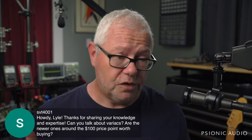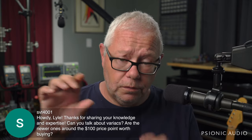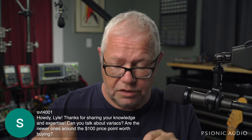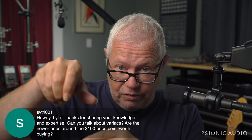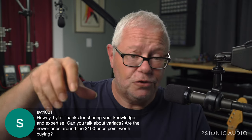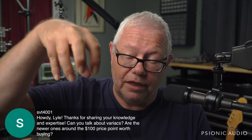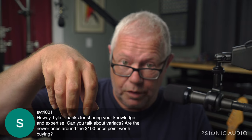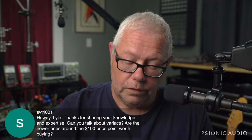So if you buy one, the first thing I do when a client brings one in is I give it actual 120 volts straight, measured exactly 120 volts, and then I turn the knob, the pot, until I get 120 volts out of it. And then usually it's not lined up to the 120 setting at that point, so I'll take the set screw out and turn the knob until the line matches where the 120 volts is, and I'll retighten it. At that point, there's a one-to-one relationship.